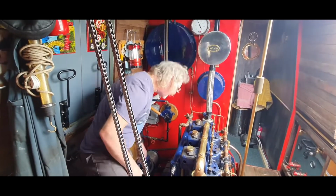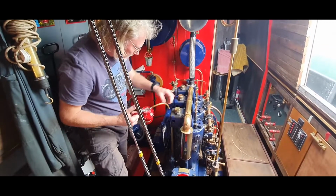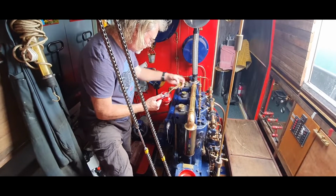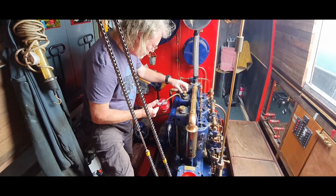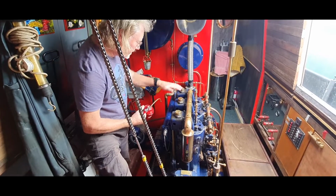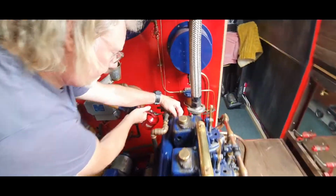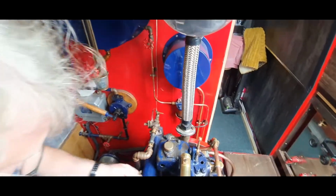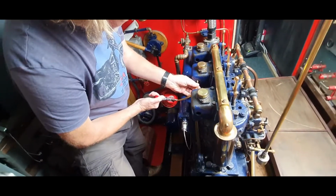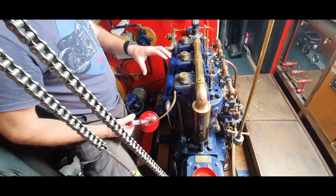That one I tend to always leave on. And then the dash pots individually. Get your oil can. So that's the 3 dash pots. Then of course the rockers which sit on the top. Just a little squirt in there. Just a little tiny bit in there on each one from each angle. And on in there. And that completes that.